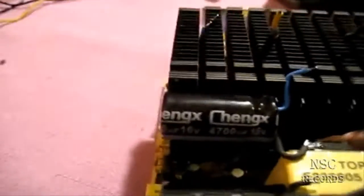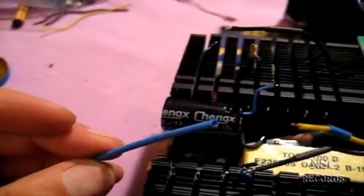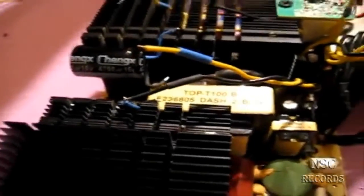Here are the newest ones - I got them today, 4700µF at 16 volts. They were really hard to fit inside because everything was too small for these bigger capacitors. So I made my own construction - I used superglue to fix them in position and they hold really well. Then I connected the contacts with heat-shrink tubing - the special tubes that shrink with heat to protect the connection.